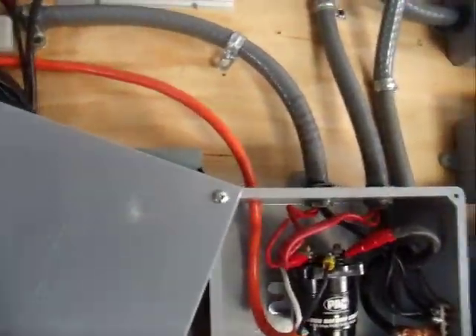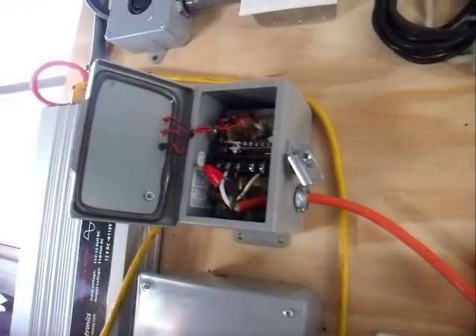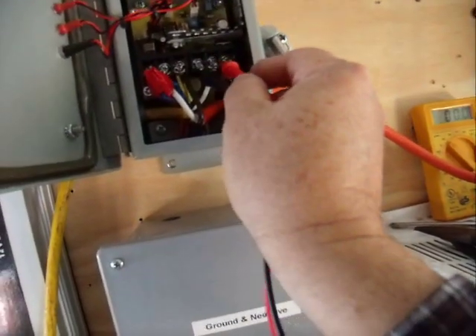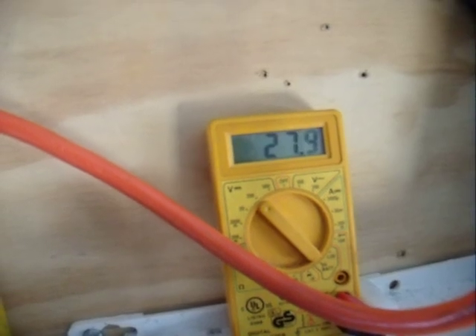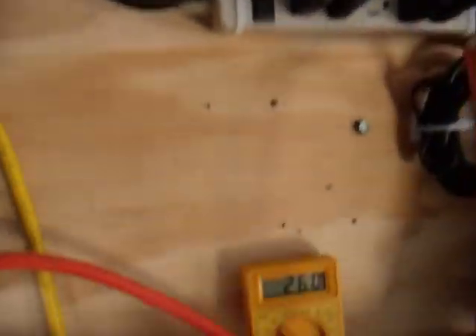As the battery voltage drops to the nominal set point that I set it for — and you can see that here — then you will see that this thing will shut off automatically. I'm going to set up my meter and turn the power reading. My battery voltage is 27.3 volts, and I'm getting that off of the sensing cables coming from this wire that goes out to the battery. So as long as this thing stays above 26.6 volts, those grid tie inverters will continue to work. When it gets to 26.6, that will automatically be shut off, and the whole cycle starts.